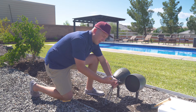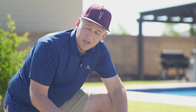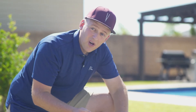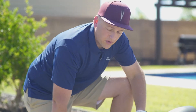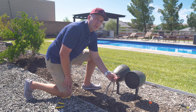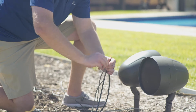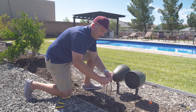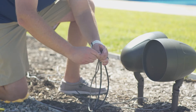From there I'm going to strip back the 14-gauge two-conductor and every wire. To make these terminations we're going to use the gel-filled wire nuts that are included with every landscape speaker and sub that TruAudio offers. There are other solutions out there such as gel-filled wire nuts, gel-filled caps, or you can solder and heat shrink your ends — all will work really well. Use whatever you're most comfortable with. We're wiring everything in parallel, meaning we're daisy chaining — tying all the red conductors together and all the black conductors together.